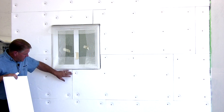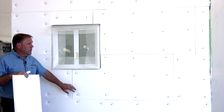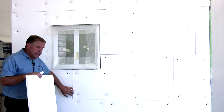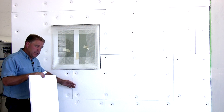What we want to show next is anywhere we have the styrofoam that has a gap in it that's not tight, what we need to do is fill those. If we don't, what happens is the base coat will actually ooze into the crack causing a solid spot and possibly form a crack through the finish or leaving a thermal barrier gap where we have the thermal penetration coming through.